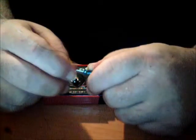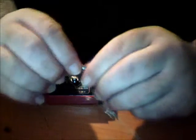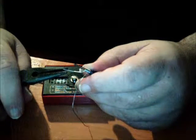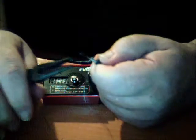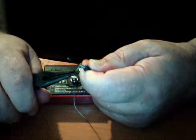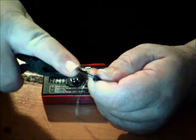8 inches of wire was a little bit too much, but that's okay — we can use that for the second one. Take that off your screwdriver, turn it around, put it back on. The reason we did 8 wraps is because we want a nice even coil. The way we're going to get that is this scrappy leg here — this garbage coil at the end — we're going to pull just one coil off, give it a little pull, and as you see it unwraps. When you're done, your legs will be facing the same way.